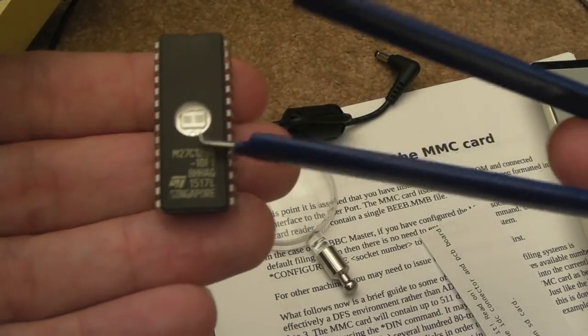Because it's all very well testing one or two games, but if you don't utilise all the RAM there, you don't really know. You could have a couple of bad blocks somewhere, a couple of bad bits on certain chips. Although, more often than not, when a chip fails, you usually get a problem with a particular bit on that chip. You know, it just fails completely. But I have seen chips myself where one specific address or a few addresses within one chip are glitchy. But in this case, this now indicates I've not got a problem. But I do know this chip is okay.